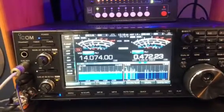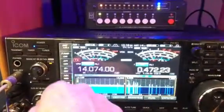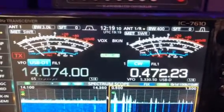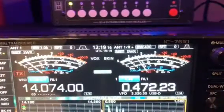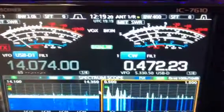I'm going to rotate the loop from its current position in a minute and show you the change in signal level. So there's the beacon — right now we're getting S4. And when he starts transmitting steady tones, I'll start moving the antenna and you'll see how quickly the null moves.